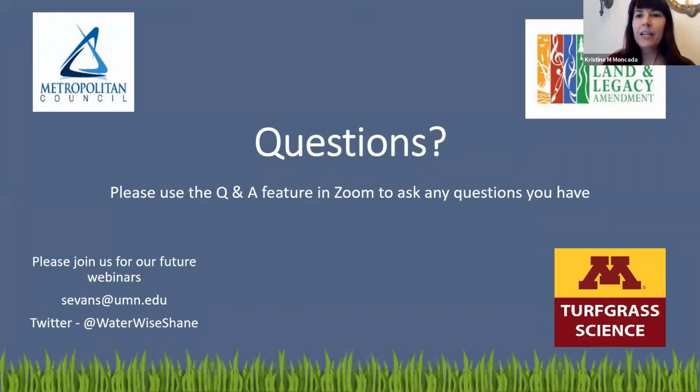Okay, so here's our last question here. I don't have an automated system, I just tote around sprinklers. Any special tips for auditing and managing that? I think the same rules could apply. If you water it by hand, maybe put out a few of those catch cups, a couple of mugs, kind of spray as you normally would, and see how long it takes for those cups to fill up. Or if you have the rainbow arcing sprinkler that you connect to the hose, you can do the same thing: set out cups, maybe on each end of the arc and some in between, and see how uniform it is, see how much water you're applying.